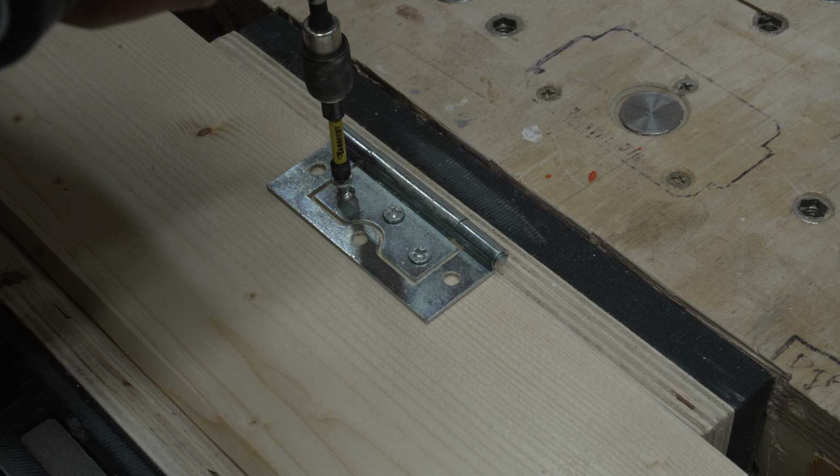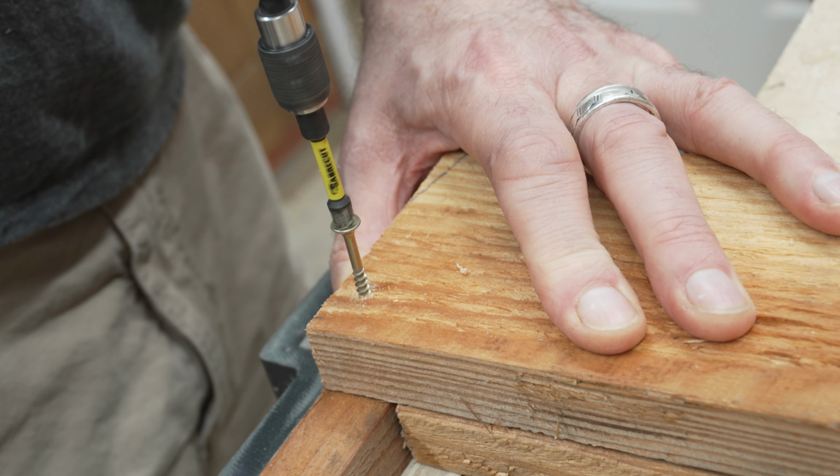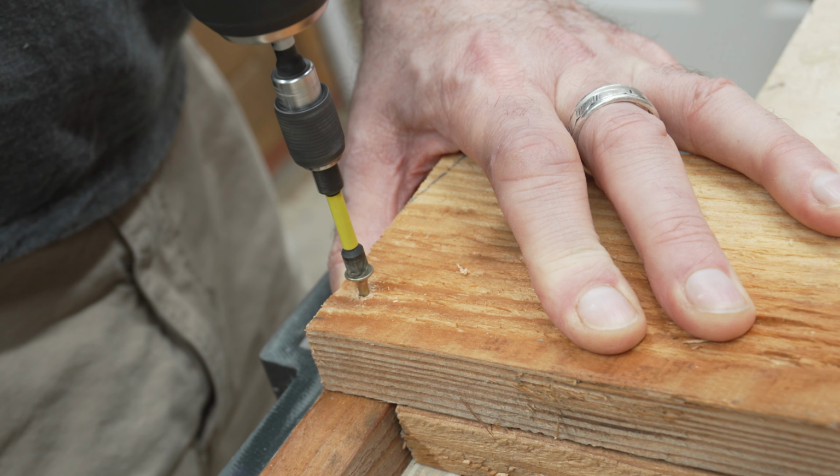It's also ideal for small to medium screws, especially if you want more control over depth, say in cabinetry or finer woodworking jobs. And because you can adjust the clutch and speed settings, it's great when you're working close to an edge or in materials that are prone to splitting. Basically, if the job needs a bit of finesse, then your drill driver is your go-to.